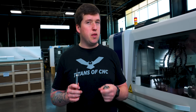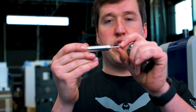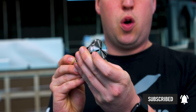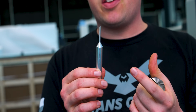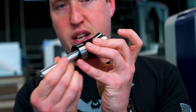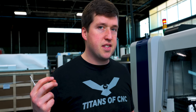The next thing we need to talk about is how we get the part out of the machine with our ejector. This right here is your normal ejector, and this is about as small as we can go — it's pretty long for being at one-eighth diameter, and you need it like that to get through your collet. What you normally do is open up your collet and knock the part out. But I would need to make this about one millimeter in diameter to eject the part in the conventional way, which is a problem because it can easily hit something in the back of the collet and bend.